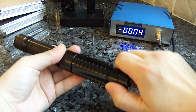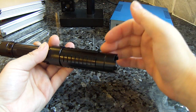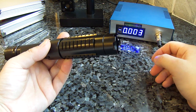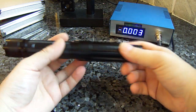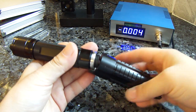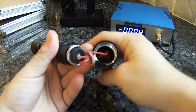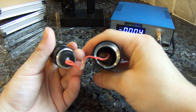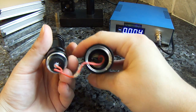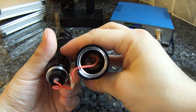You can quickly swap out the lenses if you want more power, and you can expect roughly around 1.7 watts compared to the already over-spec 1.3 watts — keeping in mind this laser is sold as a one-watt package deal. The overall internal construction is very good — it's not messy like a typical overseas laser. Everything is nice and clean, glued together with thermal adhesive. As you can see, the brass heatsink is deep inside, with the driver sitting right behind that.